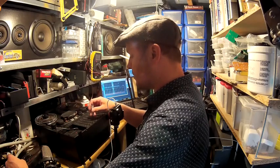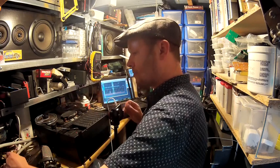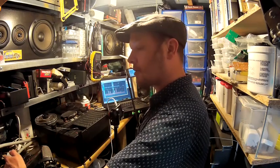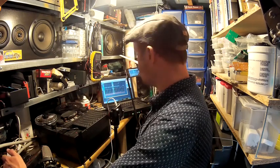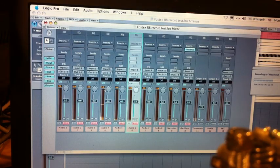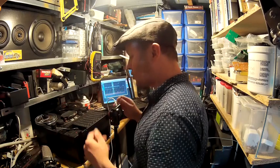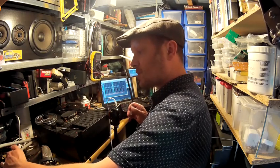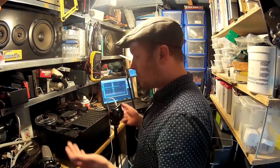A little bit less bias perhaps — I think I've gone a little bit too far. Every time I press play and record I'm resetting the tape counter, which reads in hours, minutes and seconds. Right, I'm happy. So now I've actually lined that up and I've got the treble response — the record EQ rather — sounding pretty much there. There is your lineup process.